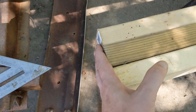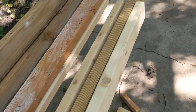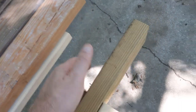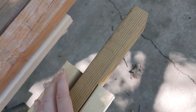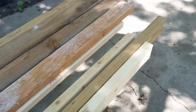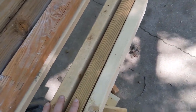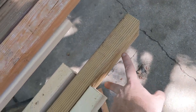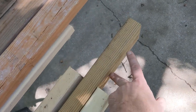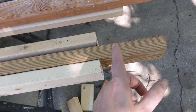Down on this end will be the bottom that goes against the leg with the casters on it. Up at the other end, I've got it notched out so these 2x8s will fit right in here, one on each side. All of this stuff will get bolted together with carriage bolts, which will allow it to be disassembled. I'll probably glue these together and bolt them. Up here, we'll have a couple of bolts running through that hold the 2x8 to this leg. You might think just a couple of bolts isn't all that strong — I've got a plan for that, so stay tuned.